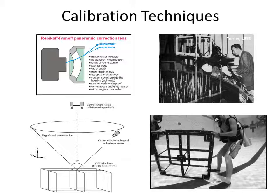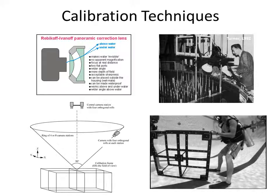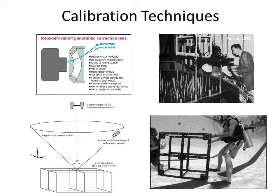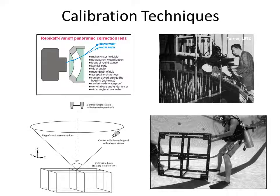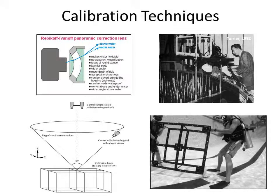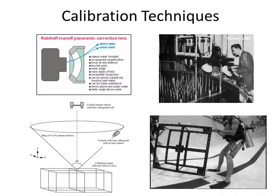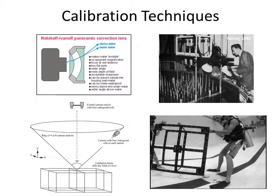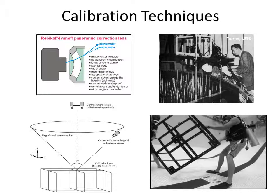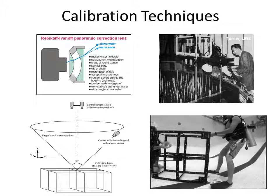The typical geometry of in-situ calibration is shown on the lower left of this slide, with the measurement process on the lower right. The geometry of the network is typical of any calibration — stability of the camera system, convergence, and redundancy are all paramount. A LED device allows synchronisation between left and right cameras, and they rotate the object rather than the cameras since larger systems are less manoeuvrable. The same considerations apply between in-air and in-water: reliability and stability are absolutely important, with the same constraints around convergence, redundancy, and rolling the cameras to accurately determine both camera calibration and the relative orientation of the stereo pair.